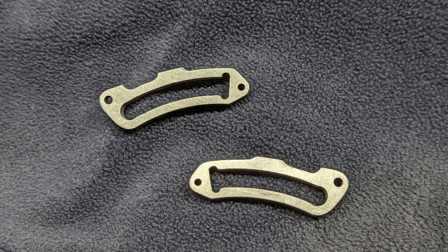Given my painful experience with making the motion plates I decided to do the expansion links separately, and as always the second part took significantly less time than the first, so I'm comfortable that I made the right decision. To complete them I need to drill and tap the holes for the expansion link trunnions, which I'll do when I make the trunnions next. I'll then need to harden them both, but as with the motion plates I won't be doing that until all the valve gear is completed and working as it should.